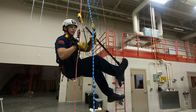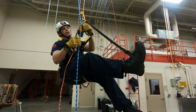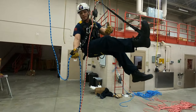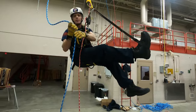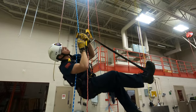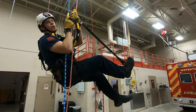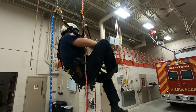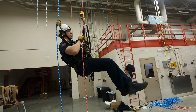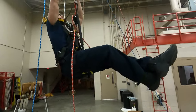Something that can happen if we're sitting here working — rescuing somebody on a windy day — is that slack can build up and the ASAP can get way down low. That is obviously not safe. To prevent that, this is where the ASAP Lock button comes into play. Just take that button there, lock it off, and it should hang right there just fine. We'll get back to that when we go into descend mode.